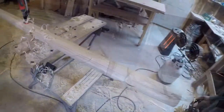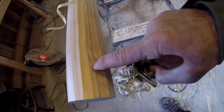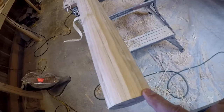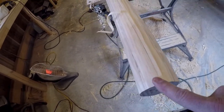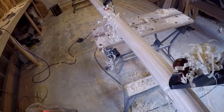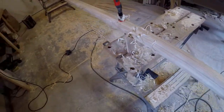Yeah, I think this will work. Basically you've got a center line here that I marked, center line here that was the joint, and I'm looking to take the corners out between these so that you get an equal-sized face here, here, and here. Of course you've got to watch not to look at that distance because I haven't done that corner yet. I think we'll just do it with the hand plane — too easy to take too much wood off with the power planer.